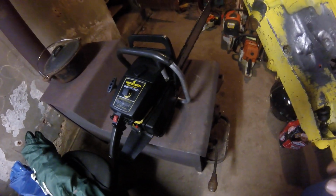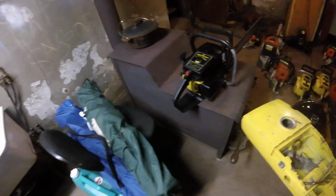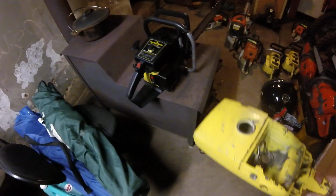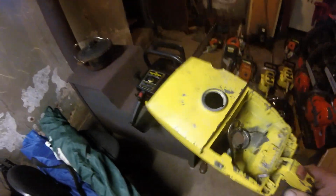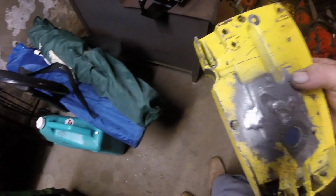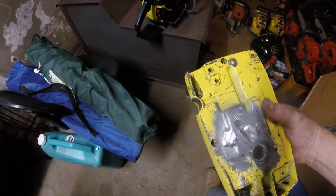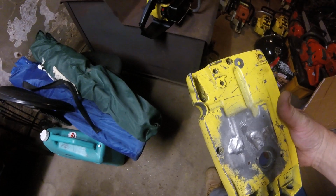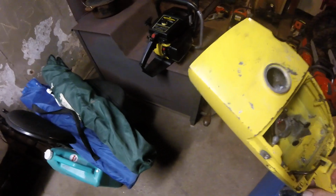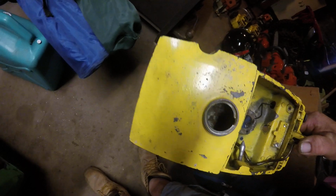The other thing I did real quick before I bought that was I went down to my local welding guy, who does TIG welding and stuff, and this is magnesium. He patched those 2 holes, but you could see here and here 2 more holes. So he kept chasing the holes. It just kept blowing through the heat, and he said it's too far gone. You could see inside it's totally corroded out.